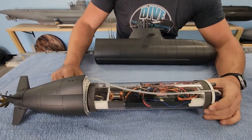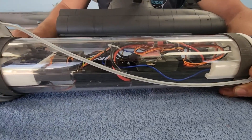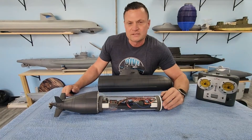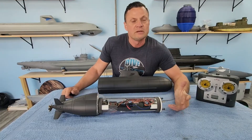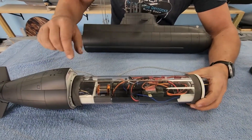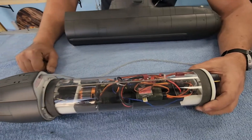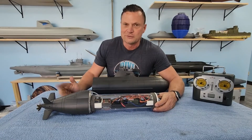You've got full access to the watertight compartment. One thing that you'll notice — or will not notice — is a ballast tank. This is a dynamic diving submarine. Because of the way it's set up, it was really ideally suited for swimming pools or small bodies of water. Bringing it up to full surface waterline was not a major consideration for us. Simplicity, reliability, and performance — those were the things we were really going after, and obviously ease of manufacturing and building for people doing that themselves. What we've got here is our 3-inch EZ Driver, rear servos, main brushless drive motor, receiver, electronic speed controller, and a remote switch and pitch controller — though that's all optional. It adds cost and a little complexity, but it does make it easier to drive and a lot easier to turn on and off.